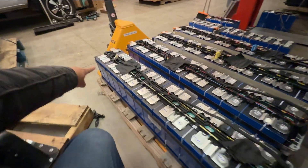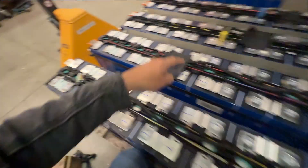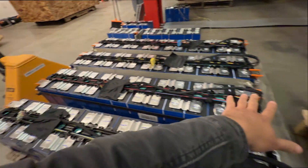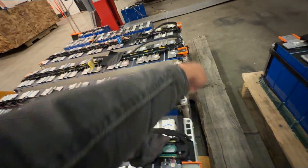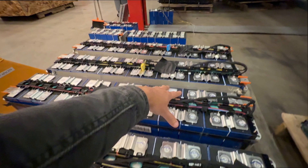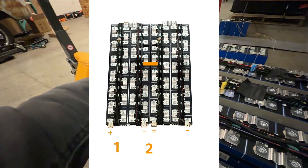There are 13 cells in the first section, so you count three more — 13, 14, 15, 16 — and there's your positive and negative right there, so you cut it right there. That creates one 16-cell battery. Then on the center module, you go eight cells this way and eight cells this way, bridge that over, and now you have a positive and negative — that's your second 16-cell battery module. On the other side you do the same: go 13 and bridge over (it's already bridged), then count three more cells and that is your other terminal.